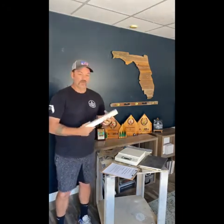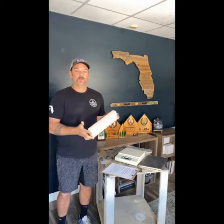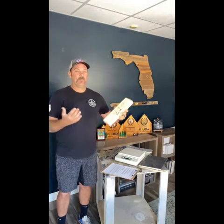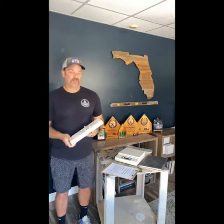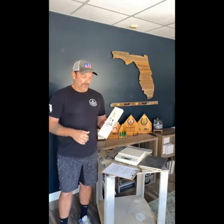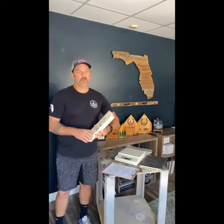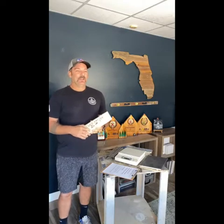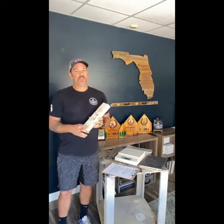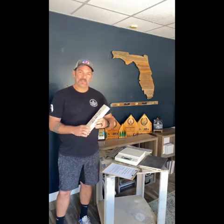When we're talking about wood framing, this is basically a one-foot piece of two-by-four — one and a half by three and a half inches — picked up from Home Depot or Lowe's. This is called spruce wood, a white wood, and it's what we'd typically frame a wall with. Some people use yellow pine or PT wood, but there's really no need — it's much heavier than spruce.